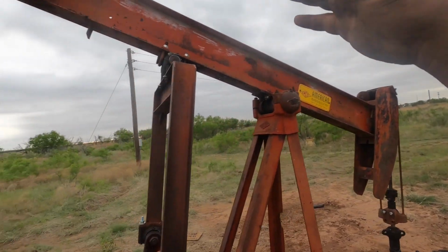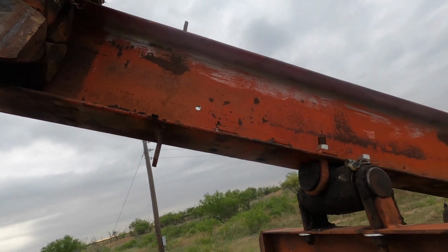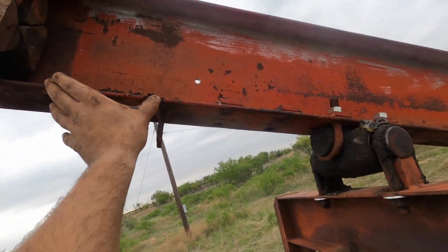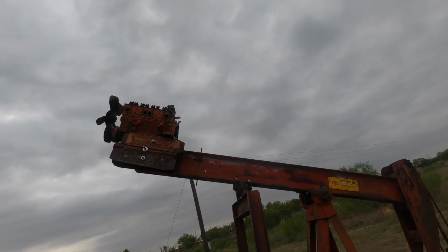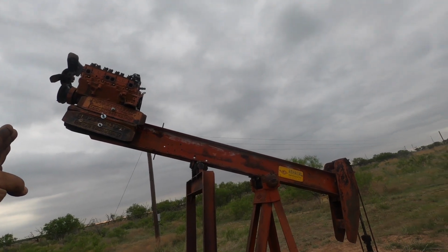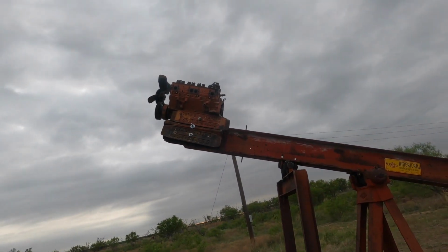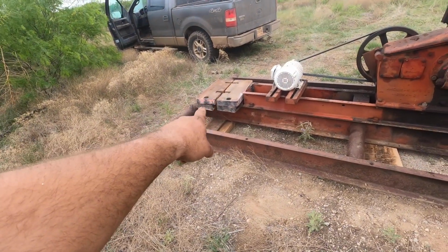It's about like this is now, but it was enough to run, and that's kind of what I was wanting to get with today. Now on that unit, these weights on an American are adjustable. It's a big leaf pack, and you can move them forward and back or take them on or whatever. And they were all the way up against here. So it had 750 pounds of weight that was right here. I'm thinking that small block weighed 500 pounds, and maybe my big mess up, it may not be that heavy, but I've scooted it back significantly, and I was thinking that would probably be about equal to what I had over there. Not enough, but enough to run. And it obviously wasn't even close. And by the way, I had some other old junk weights off, I think that was a Cabot maybe, on the other side of the lease.